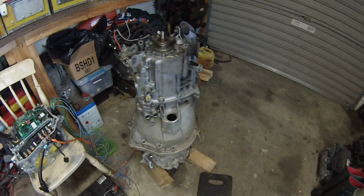It's just running open loop control, so it can be a pain in the neck, particularly with permanent magnet motors. Let me go up to 7 Hertz. Oh, we're losing that. We're losing our captain. We got her back. Let's see if we can squeeze ourselves up to 10. Oh yeah, okay, now we're running at 10 Hertz.